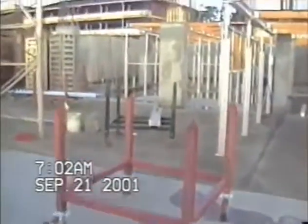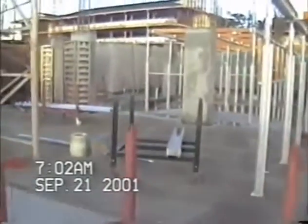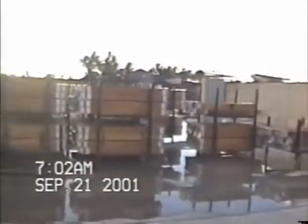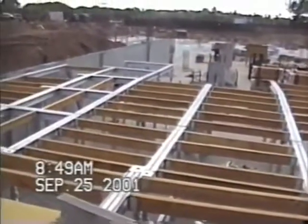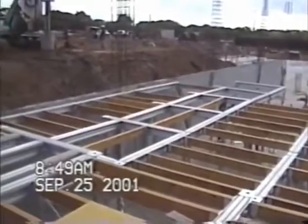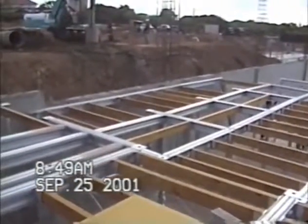This view is 6 hours later and we have set nearly 5,000 square feet of equipment. This is the Marriott on Kauai. You can see the joists hanging in place and also notice the storage carts with casters used to move the shoring material throughout the job. All of the equipment is shipped in these storage carts as well. This overhead view shows the versatility of placing ledgers and joists in two different directions to meet concrete geometry.